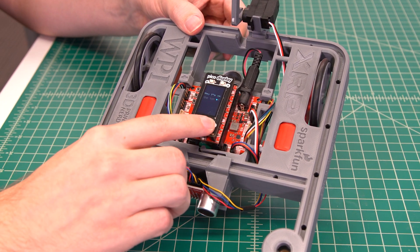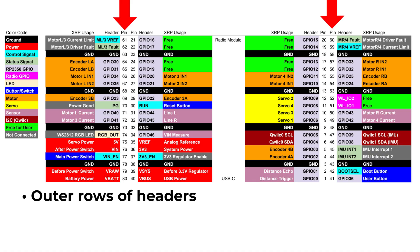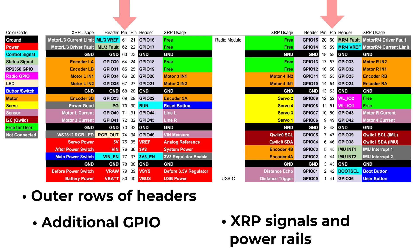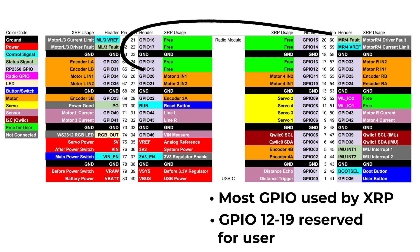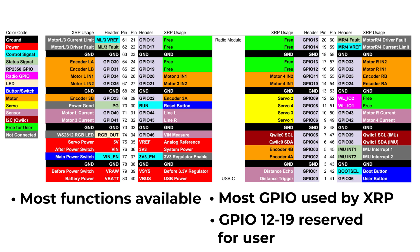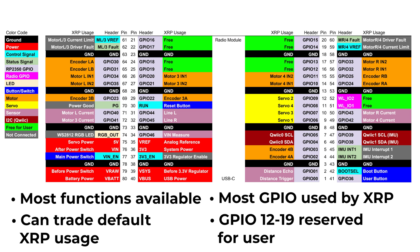Be aware that many of these add-on boards are designed to go on the bottom of a Pico with male headers, whereas the XRP has female headers on top. To ensure those add-on boards can be used with the XRP, we created the Pico Add-on Flipper, which flips the header rows and genders so those add-on boards can be used with the XRP. The outer two rows of headers provide access to additional GPIO pins, XRP-specific power rails, and XRP-specific control signals. Be aware that most of the 48 GPIO pins have some default usage on the XRP, such as controlling actuators or interfacing with sensors. However, eight of the GPIO, specifically 12 through 19, have been reserved exclusively for the user with almost all functions available. If you need more GPIO, you will have to trade their default XRP usage — for example, using a GPIO that interfaces with a motor means you will no longer be able to use that motor connector.